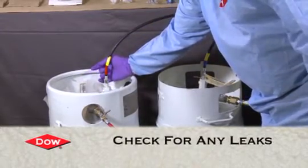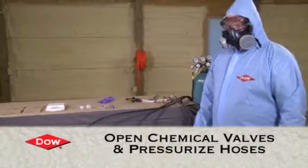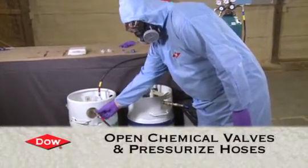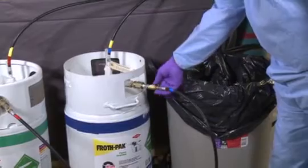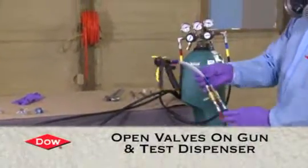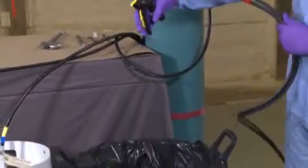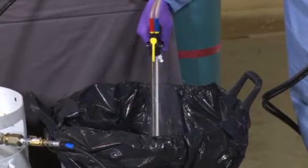All the while, he's also checking for leaks. Now that the system's pressurized, we can turn the chemical valves on and pressurize the chemical hoses — checking for chemical leaks all the way. You can hear the chemical rushing through the hoses as he turns that valve on. Now we're going to check the gun to make sure it's in working order. He's going to open up those last two chemical valves, and you'll see chemical flow into the gun. As soon as he pulls the trigger and purges the hoses of nitrogen pressure, you'll get two good chemical streams. He's all set — good chemical flow.